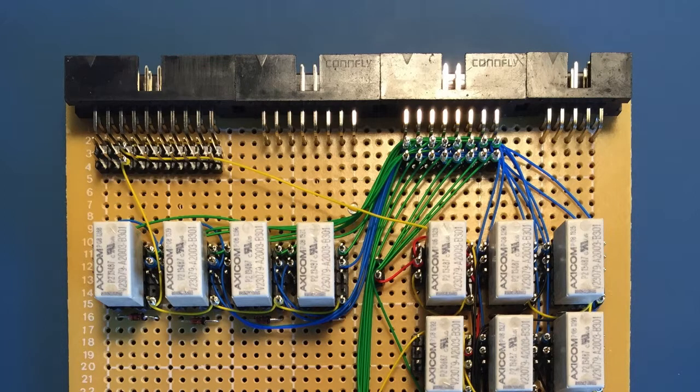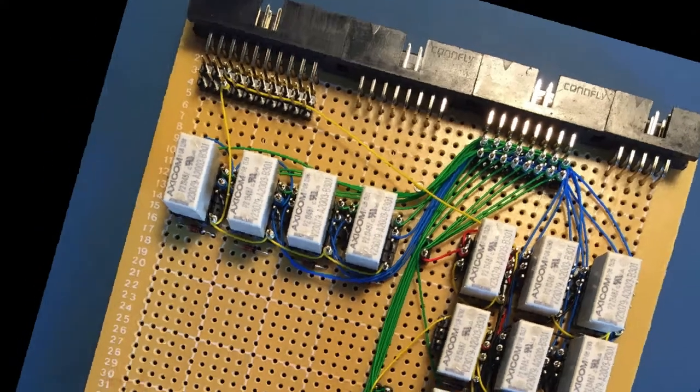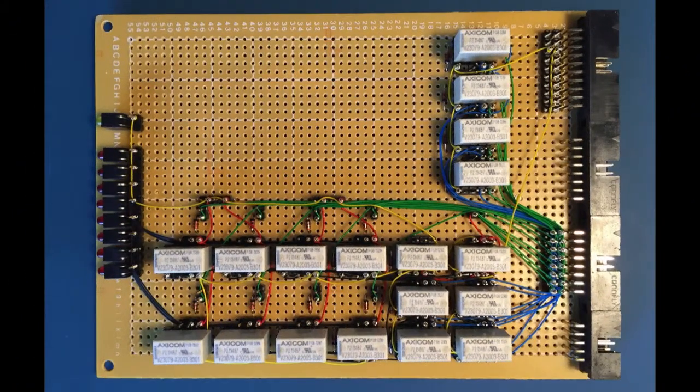Generally, the card is fairly similar in design to previous registers, except that the instruction register can only be loaded, not selected. This is because it's permanently connected to the instruction bus, which will then feed the upcoming decoder and controller cards.